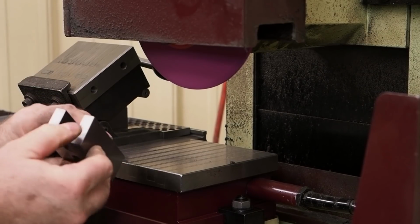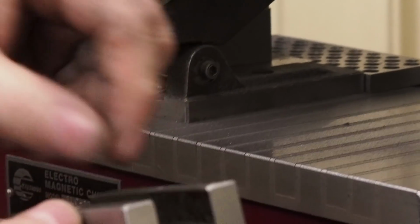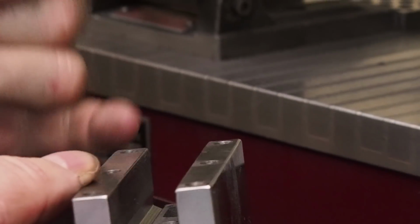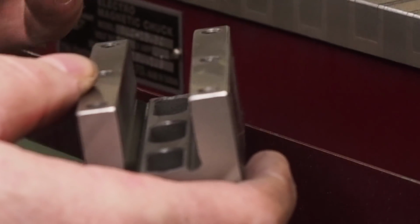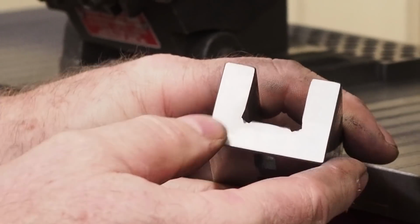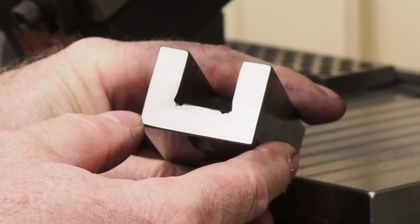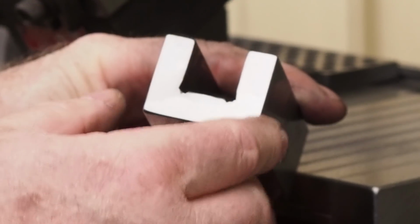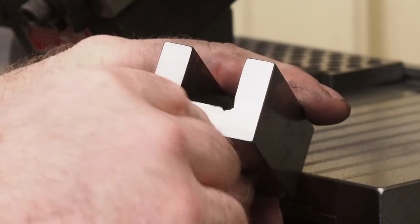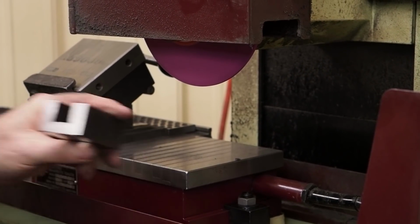And by cutting the corners out like that, make it nice and wide when I set this up to side wheel it and cut the bottom on there, I can put something that's dead sharp square in there and know that it's going to hold good. But this is, again, just the method that was used to make a nice wide cut. The wheel I used was a cup wheel. It's the closest thing I had to a narrow cut, so as I was coming down it was cutting more into the wall. Makes a little bit more noise, but it works out fine.